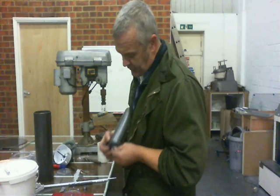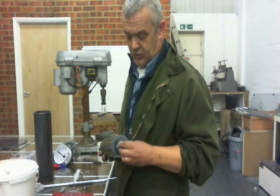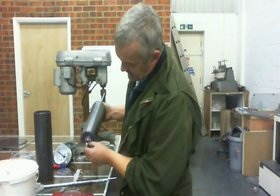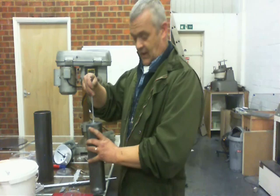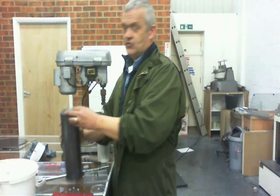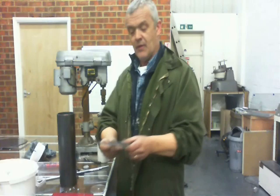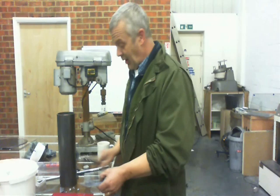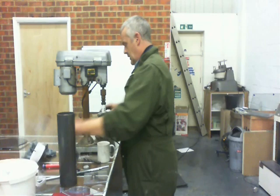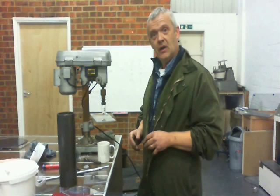I put a nut on the top and my modified nut on the bottom, which gives a fitting that sits nicely in the bearing and will spin quite well. For the outer case I've done something very similar — placed plastic pieces inside to give a nice center and fit. The plan is to glue them onto flat base plates, drill eight-millimeter holes, through-bolt with eight-millimeter bar, then drill out to 22mm for the bearing. One disc at four millimeters isn't quite enough, so I need to cut and stack a second disc to hold the 22mm race bearing in place.